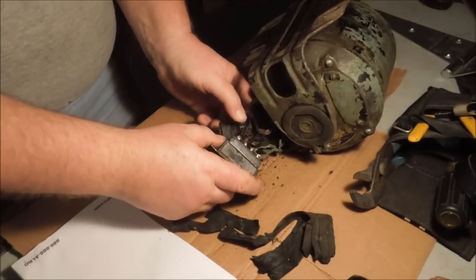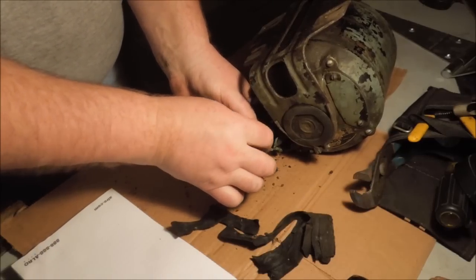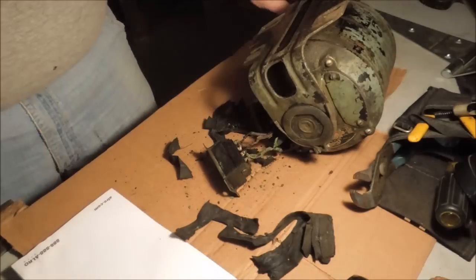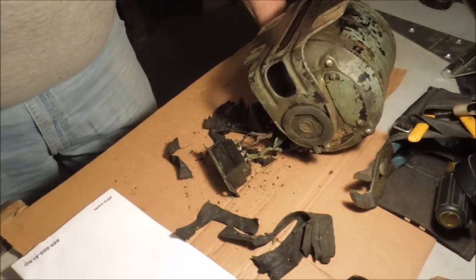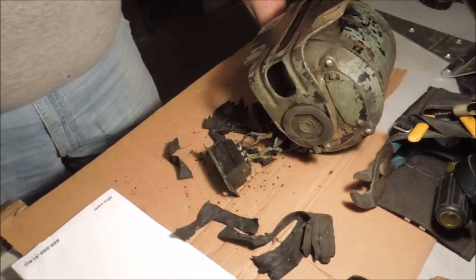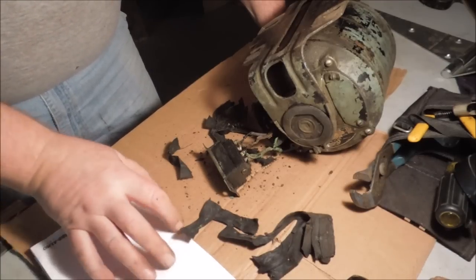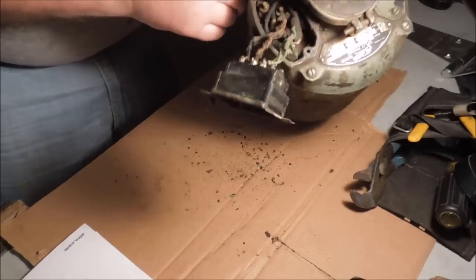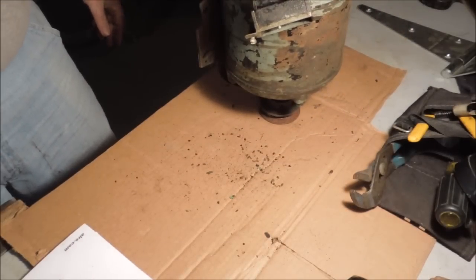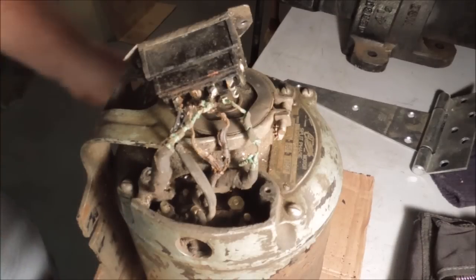Oh man, they soldered this thing together. It is a mess. The reason it had problems is they put it together with lamp cord. Stranded wire, too small. It's a quarter horsepower motor. Doesn't sound like much, but it draws more than what a light bulb does. It's only by the grace of God that this thing even lasted as long as it did. I don't have any wire tags, so I'm gonna make do.